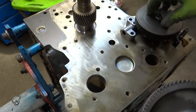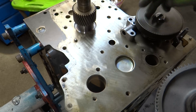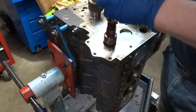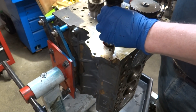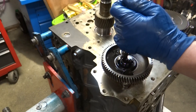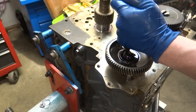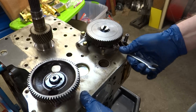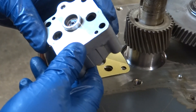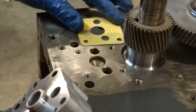There are a bunch of springs that go along with this, so I'm going to try to get all that set up first. I'm going to do the injector pump camshaft first and then see how we go. I'm fitting the camshaft in there to get that out of the way, and the manual calls for about 20 foot-pounds on that, which will hold the injector pump cam in place.